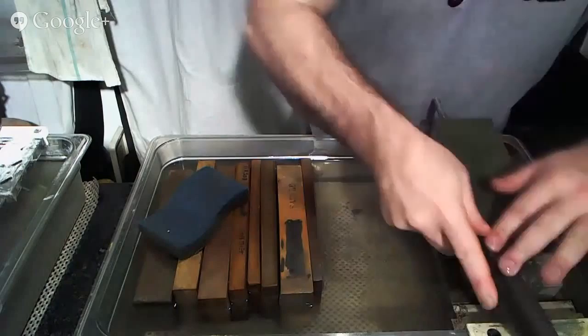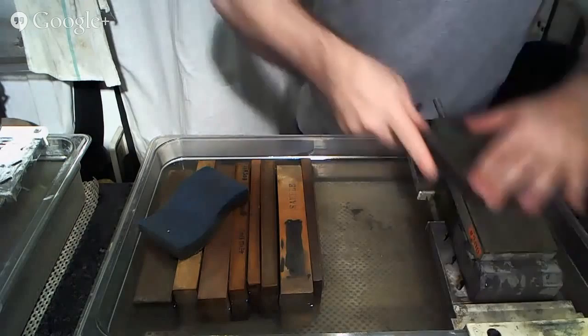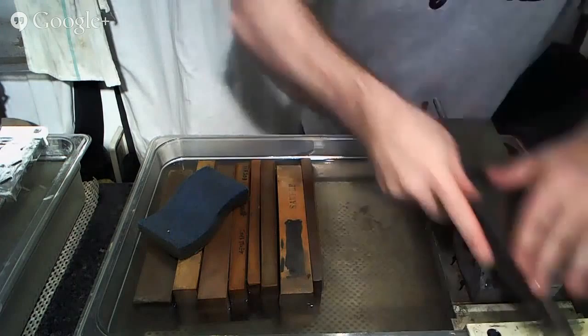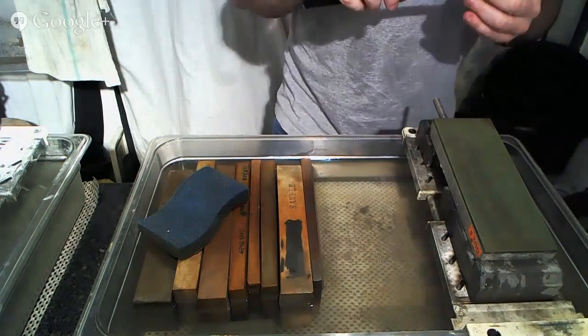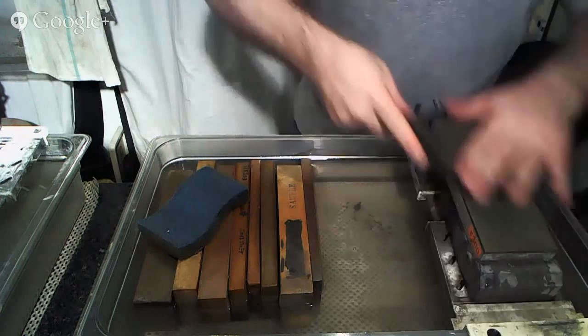Now, I have a lot of customers who are sharpening knives similar to this, or more rustic knives, or things they've bought inexpensively sometimes, and they're just getting started with sharpening, and so not everyone's really comfortable with stuff. And what they notice is that the bevel is not consistent, and they're convinced that it's something that they're doing wrong. And chances are, if you're just getting started sharpening, it might actually be something that you're doing wrong. But I sharpen a lot of these knives, and I have a little bit more experience than many. And what I've found is that sometimes what will be scaring people is actually a small grind issue in the knife. And it's nothing that's going to cause any trouble over time, but it is something that's going to make the bevel look uneven and inconsistent as you go. And it's because there's a little bit of high, a little bit of low spots along the bevel.